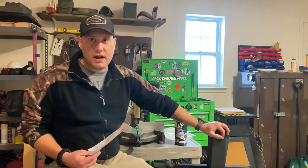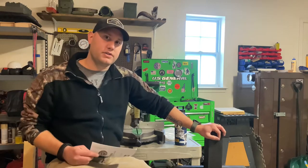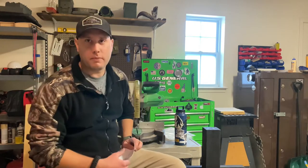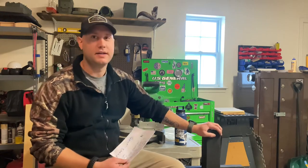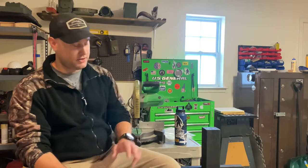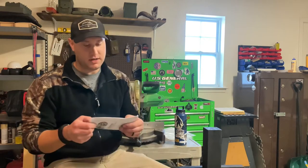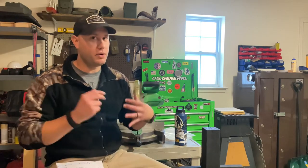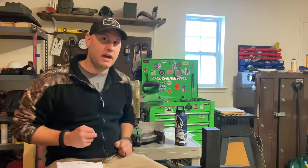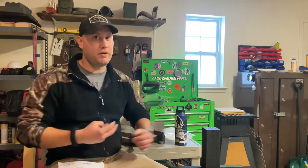I'm going to have this in the comment section and in the description. However, your cut list, you're going to have one 4x4 as the post at 42 inches. The two arms are gonna be 24 inches. And like I said, 24 inches, and make sure you center them just right. And that makes sure those two ammo cans fit perfectly in there.